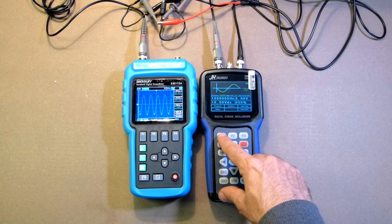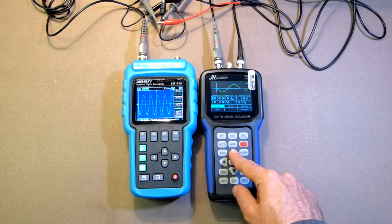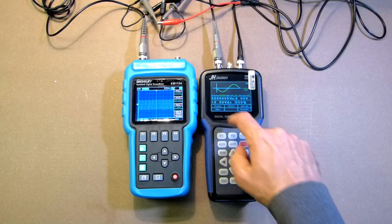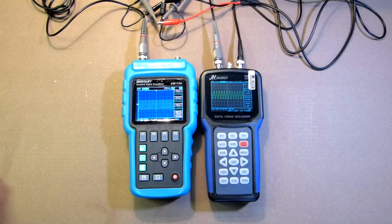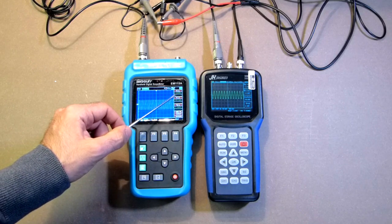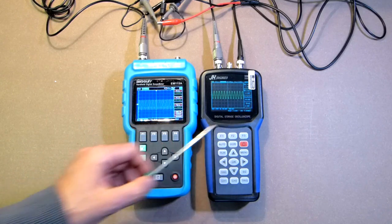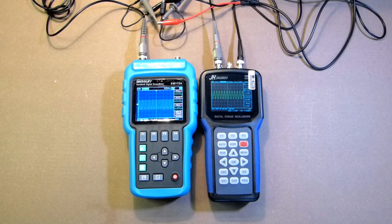Signal generator. And let's check the maximum for this device. So in case you choose even 9 MHz and press OK, it's 5, because it's the maximum for this device. Okay, oscilloscope. So now the frequency is 5 MHz. Here we have the frequency of 4.999 MHz. The voltage is 2.48 and here the voltage is 1.44. So this device recognizes the signal as approximately twice lower.